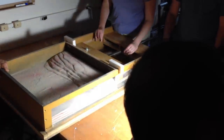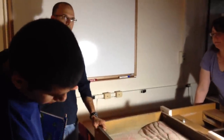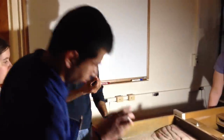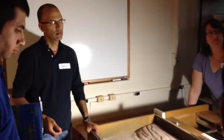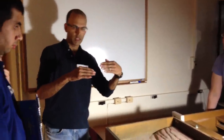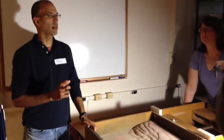I tried to make an effect like this by putting a thick layer of talc on the base on one side versus the other, and it didn't appear to make any significant difference. I was wondering if it had more to do with the internal strength of the sand pack. Well, the talc might not have enough of a reduction in friction, but it's also so small that it gets stuck up in the grain. You're talking about a total friction range between 0.7 and less than 0.1 — it just gets injected up into the structures. What we've used in the past is graphite powder, which is even lower friction. It definitely makes a difference.